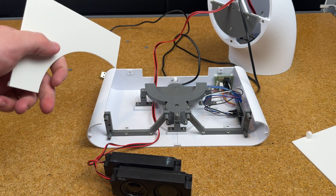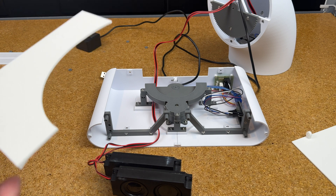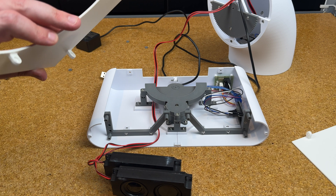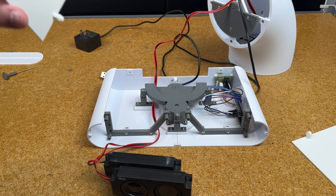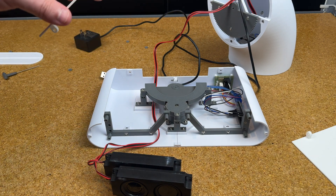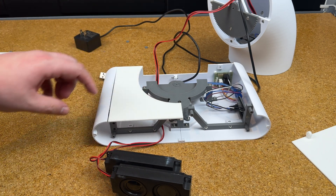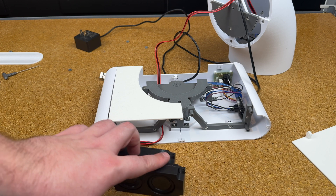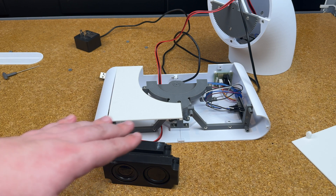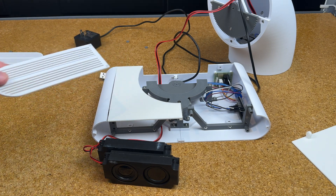If this white looks a different shade of white than this, it may or may not be because I ran out of this filament and had this lying around — which is not the same brand. Basically these pieces don't have any recessed nut holes in them — well, they're not supposed to; this is an older version. They just get placed right here and screwed in with screws from the front through the speaker mounts, and then one in the back. We'll put these in, mount the speakers at the same time, then the neck goes in, then speaker grills, and then done.